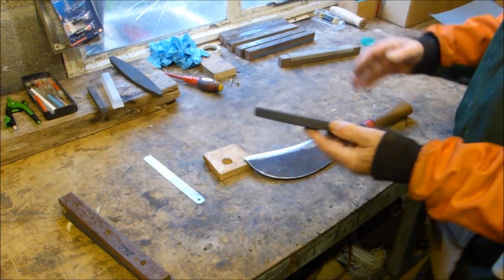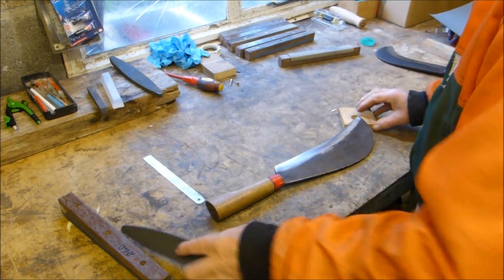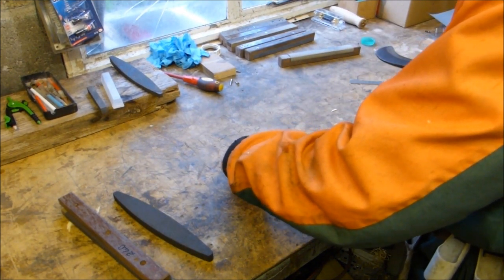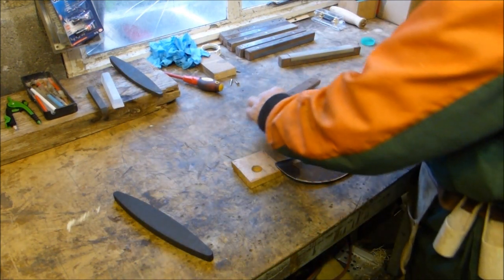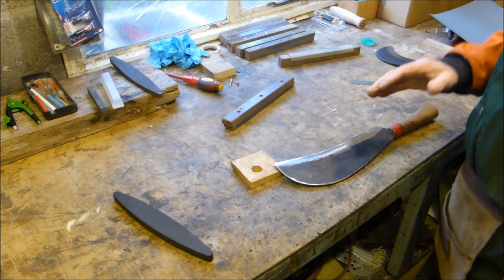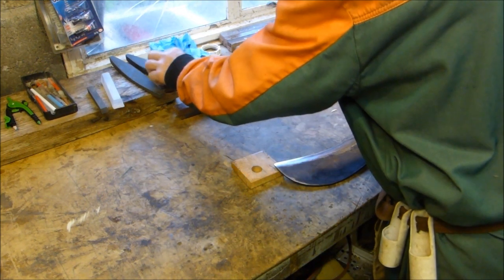The way you would do this, and I won't touch this because it is sharp, but you do that there, and then you turn it over, and then you do it there like that, because that is designed to fit like that, as I said before, and that's that. And I use these again, starting at 240 grit, there it is, and going up to 600, 1000, 1500, 2000, 3000. No need to go beyond 3000, because at 3000 the grit is sufficient to pretty well make it as sharp as you require.